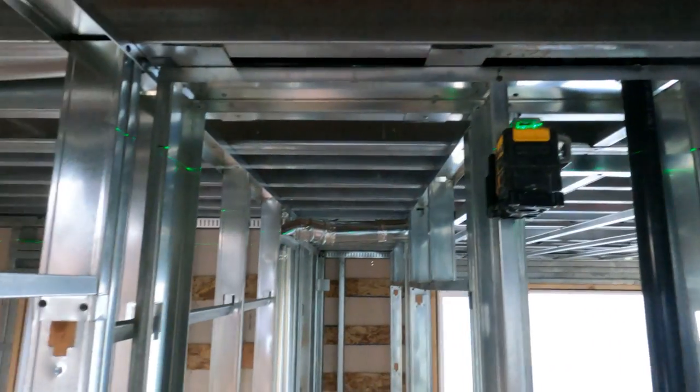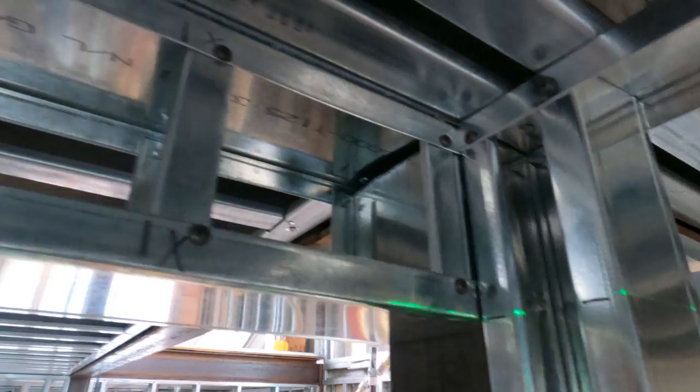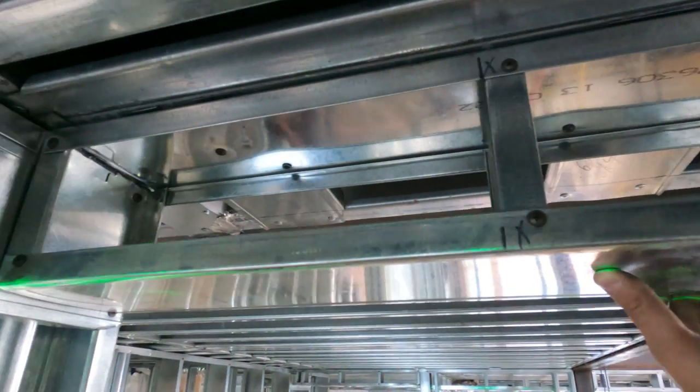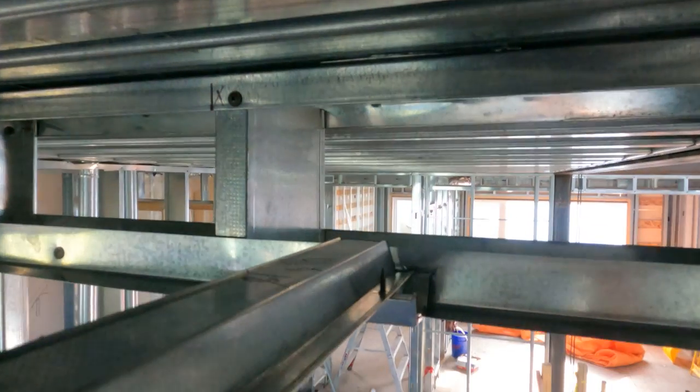Bulkheads — this is a kind of important thing with ceilings guys. You've got to make sure you have a full perimeter, and if you don't have one you've got to put a bulkhead in. This is the second full ceiling we've done and we've been putting in lots of bulkheads — same thing every time.